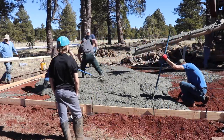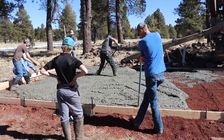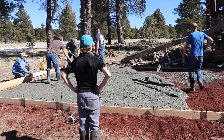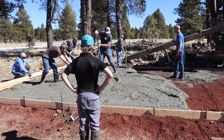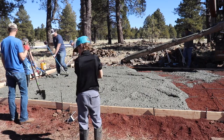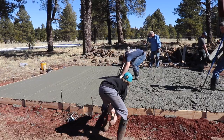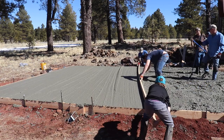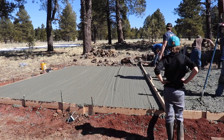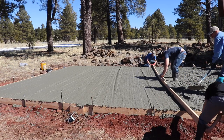This was a rough 20 minutes. I had originally planned on the concrete truck backing all the way up into the forms and just being able to place the concrete where we needed it, but the truck couldn't make it all the way back. So we ended up doing a lot of pulling and moving. We used 11 yards of concrete total for all of the columns and the slab, so this one side was probably about four of those 11 yards — and pulling four yards of concrete is not very fun. A pump might have been better, but this worked out and I'm thankful to have all the help we did.